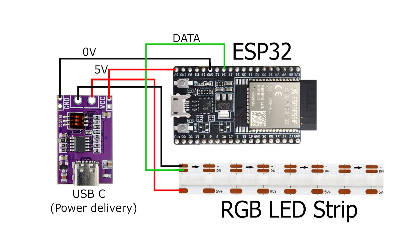The reason I'm using this little power delivery board is because it's difficult to connect directly to a USB connector and I didn't have a breakout board. It keeps the battery pack enabled all the time, and it has another advantage: it allows you to set the output voltage from USB-C from 5 to 20 volts. That's not needed for this 5-volt RGB strip, but if you had a 12-volt strip you could use it to power that. That's all you need - let's go to the lab and solder this up.